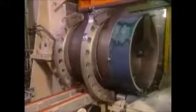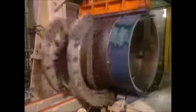And this is the back panel of the drum, the rotating compartment that holds the clothes. Note those small holes. We'll come back to them shortly. To form the side of the drum, the machine bends a sheet of pre-painted steel into a circular shape.